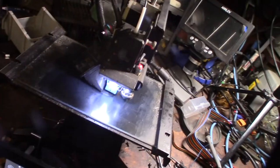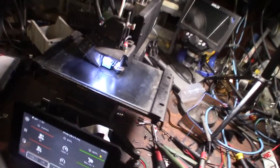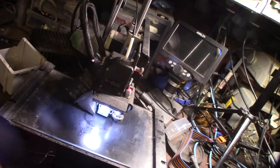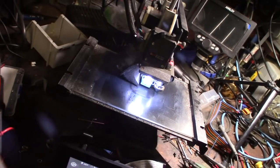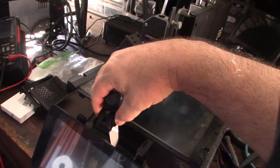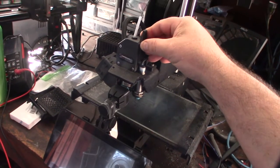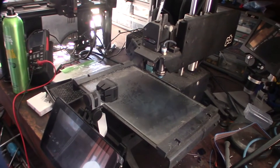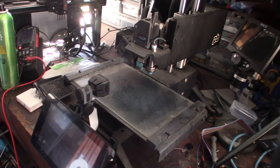I'm getting a low voltage warning and I notice my lights flickering. The power supply should be powerful enough, but I really should convert to a 24-volt power supply. Then I'd have to replace all the fans and the heated bed, which is 12 volts. Making progress though. I put the camera mount on the LCD mount - I created a little mount here but the issue is it could hit something. It's a pretty cool mounting system on Thingiverse - I modified my own version and might print one to go in the corner.